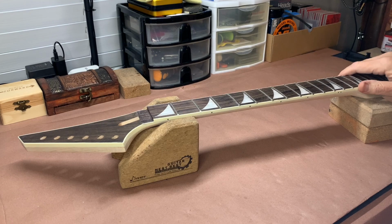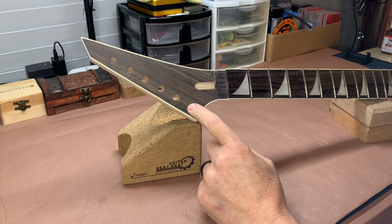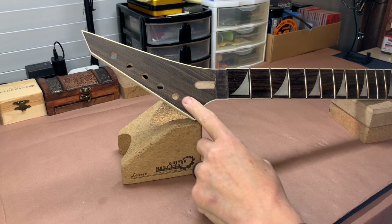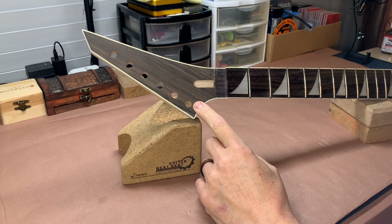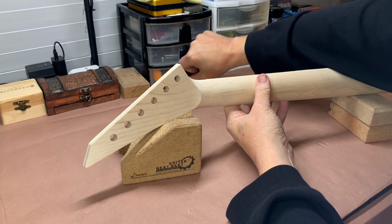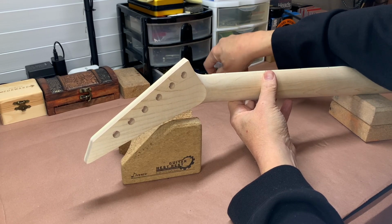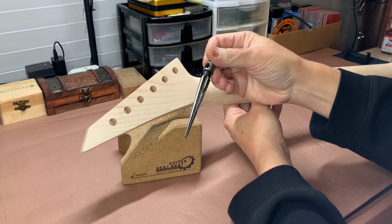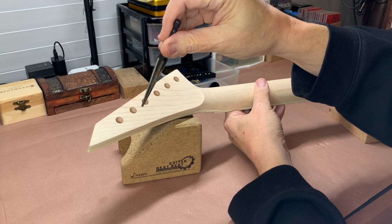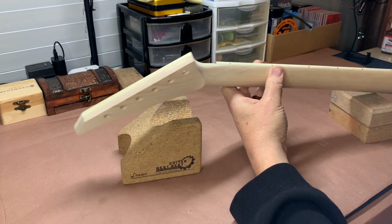Okay. Now for my particular project, these are 8.5 mil ferrule holes for your tuning machine heads. Typically on an import kind of neck, they would be 10 mil. Most of the tuners are 10 mil except for vintage tuners. So I am more than likely going to deploy this bad boy right here. Got it on Amazon. I'll drop a link in the description for you if you're interested in that. And turn those 8.5 holes into 10 mil holes in order to get the tuner situation working.